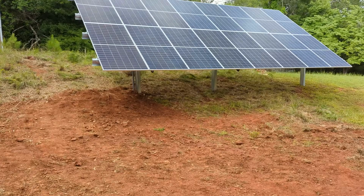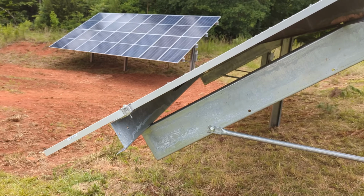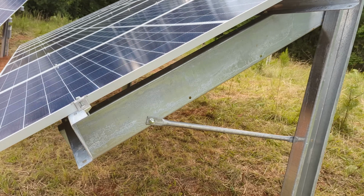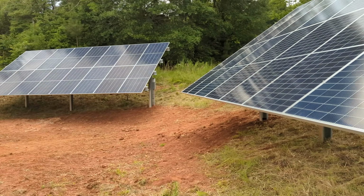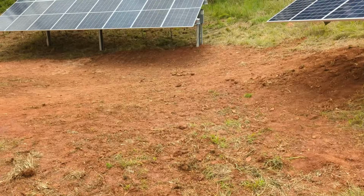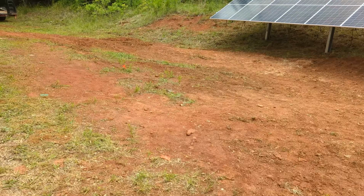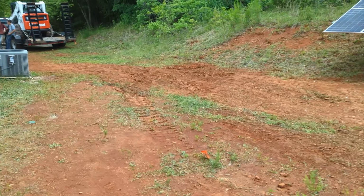This first one I've done on a kind of a bank like this. I like the lead length on these Canadians was a lot longer. Didn't have to make any jumpers. So super easy to wire up. 2 strings of 8, 2 strings of 8. And I pulled it in, even though it's very close, I use number 8s. So no voltage drop, negligible voltage drop on this job.